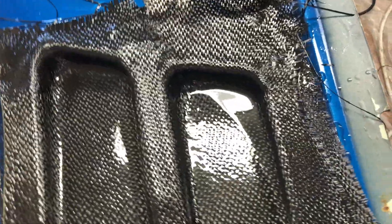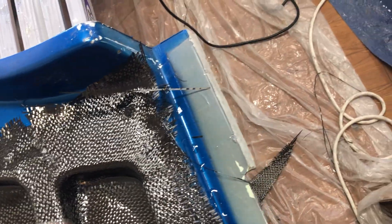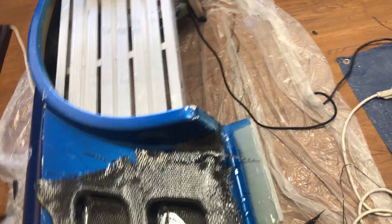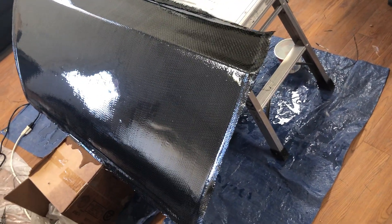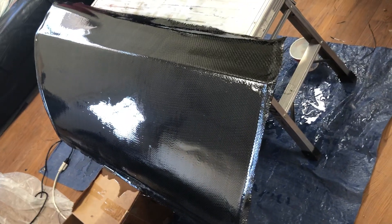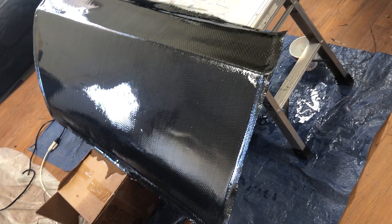We did have a little bit of pooling — actually a lot of pooling right there. So I've got to decide whether I want to mess with fixing that. I think I will — got to sand that smooth. We should have set this thing level before we left, but we put it on there and then left, and the next morning came in and it had pooled there. Here are the door panels. These have not been touched since they've been made — we wanted to give it plenty of time for the epoxy to cure before we started sanding. Now is that time.